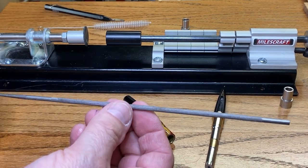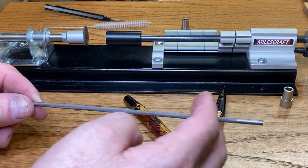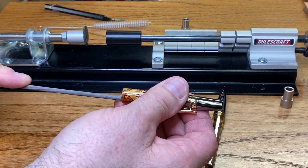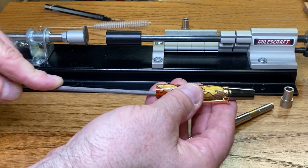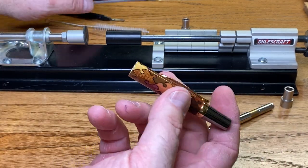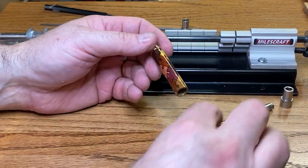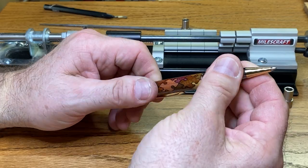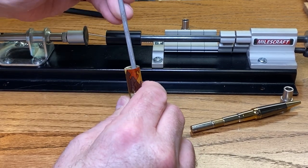This is a chainsaw file. You can pick them up at your big box store. I like to use these because they're usually a fairly high quality file, and they don't taper. They're the same dimension from end to end. It's much easier to file a blank without the cap in there, but I think the area we're having trouble with is close enough to the front of the pen that we should be able to go ahead and file it right out, and you can see the white on my finger. That is probably CA glue. All right, let me dust it out of there real good. Let's try again. Hopefully she works well. If not, we'll adjust one more time. Still a little bit of drag. It's working much better now, but there's a tiny bit of drag, so I'm going to take some more of it out.